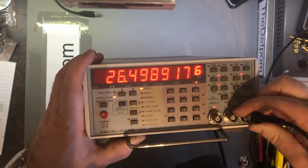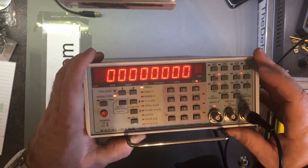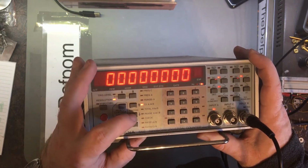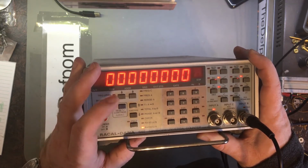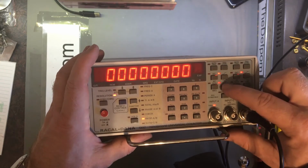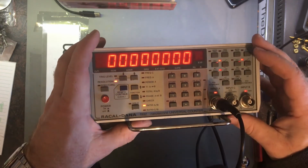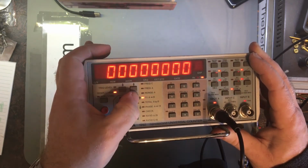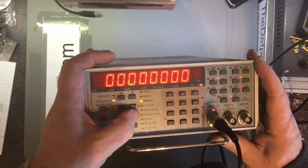Okay, well, let's try input B, because, you know, why not? So input B showing triggering at least. I don't know how to use this stuff. That's not turning off. There could be a dodgy button there. But yeah, trigger A is not showing any. If I do that, it comes up. Input A might be blown. We'll have some kind of issue there.